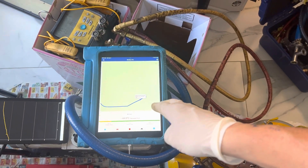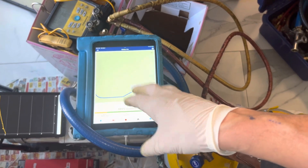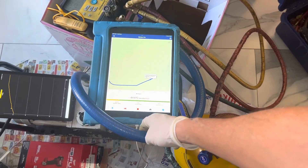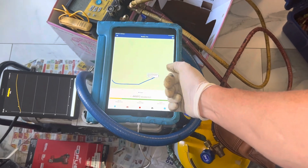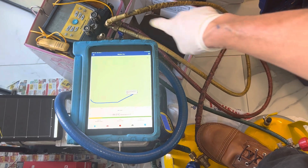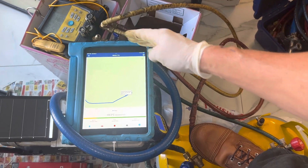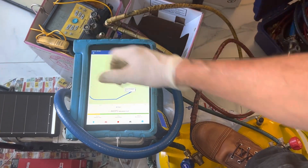We're back on this series of videos on using a micron gauge, understanding what effects rubber refrigerant hoses have on it, and the difference between a silicone dedicated vacuum hose. Later we'll go into metal lines — I will fabricate a metal refrigerant line off of my gauges using soft copper, removing rubber hoses entirely and using all metal coming off the gauges, but that's much later.